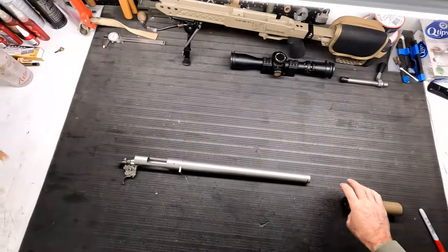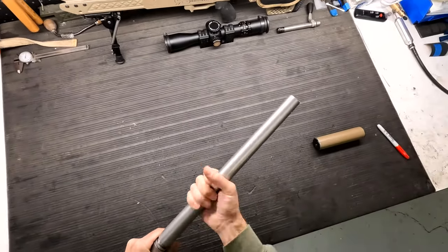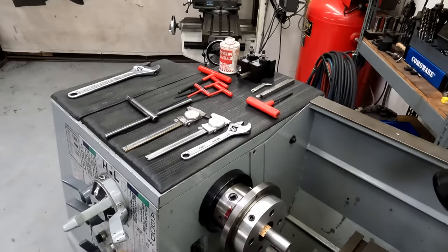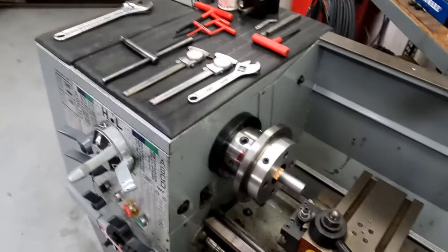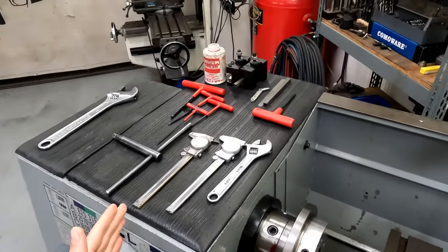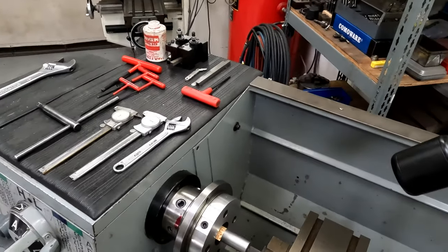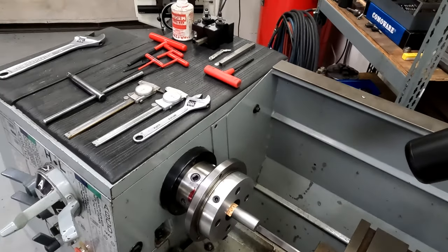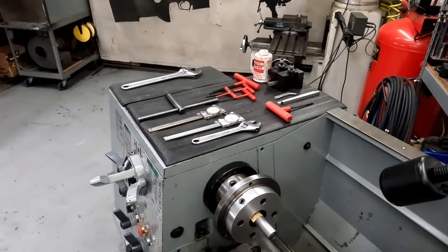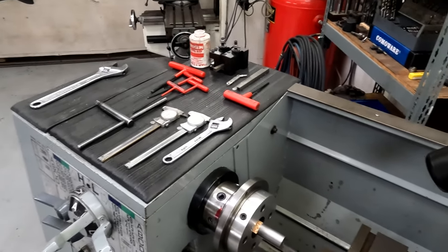Next step — get this sucker in the lathe. We're going to face it off and dial it in. Lathe mode — took the sweater off. You don't want to be wearing any loose clothing around the lathe. Eye protection. Safety first, then teamwork — remember that. We've got her chucked up here in a custom four-jaw chuck that we made, and we've got a spider on the other end. We used a grizzly rod method to dial this in — you can see that on another one of my videos. This thing's all chucked up and ready to go, indicated, with a rough face on it.